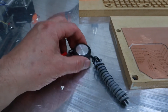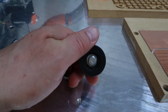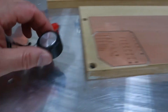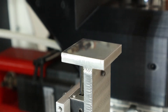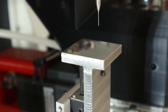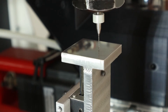This is one of the common tool length sensors or part height measuring sensors that you can buy off Amazon, eBay, and a number of other sources. They cost a couple of dollars. I purchased one and frankly I thought it was going to be something a little better than it was, but realistically it only costs a couple dollars so I got exactly what I paid for. What I really don't like about it is there is no mechanical compliance built into the device. If the tool comes down on it with any force before it can stop moving during the measuring cycle, you just broke your tool.